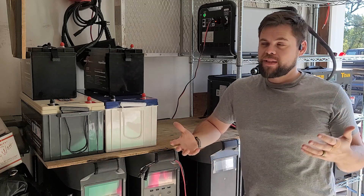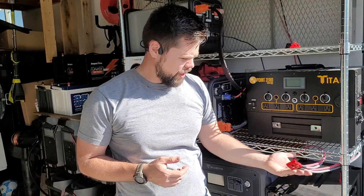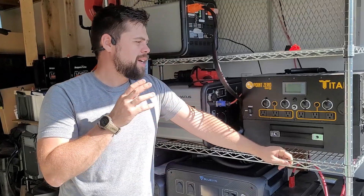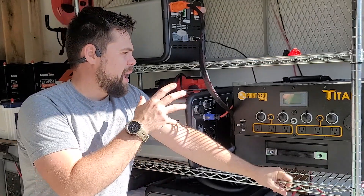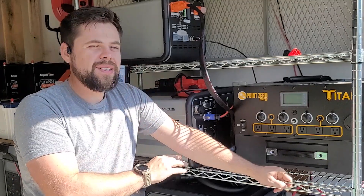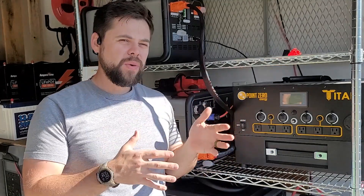If you're going to use higher quality equipment, it should be relatively easy to figure out what's going on. The advantage of going with something like a Titan solar generator is that you can use more Titan batteries, connect them externally with a cable, or even use other lithium iron phosphate batteries with a different connection cable. The Titan is literally the only unit on the market where you can use a different brand of battery — just has to be lithium — and it's very easy to program. I've been running my entire cabin nonstop for over two and a half years off the Titan solar generator with three batteries. But you'll never get 240-volt power out of it; it's only capable of 120-volt with a 3,000-watt inverter.